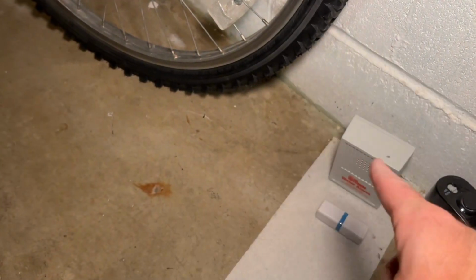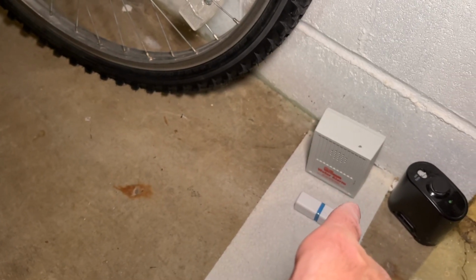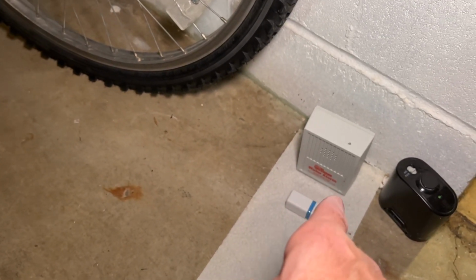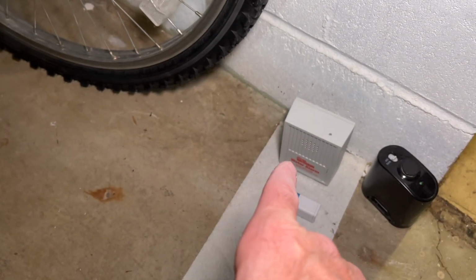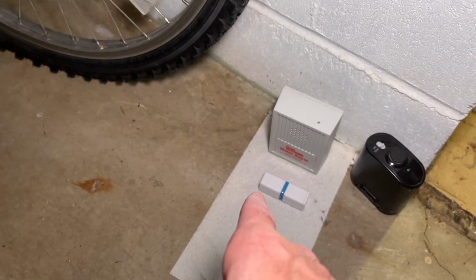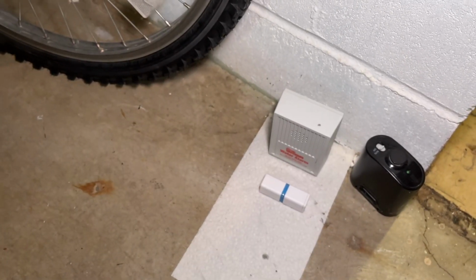But water will go past this corner if the humidifier leaks, but also I have the condensate drain on the furnace that could also leak. Again, shutting the water off is not going to remedy that issue, but it will still notify me of it. So it'll be a minor inconvenience to have the water shut off, but it will be made up by the fact that I know that my condensate drain is clogged.